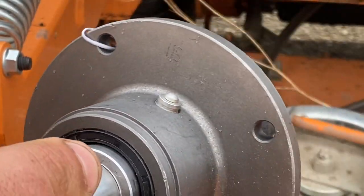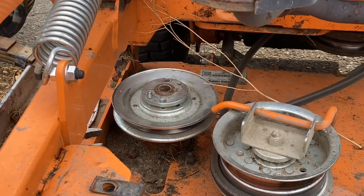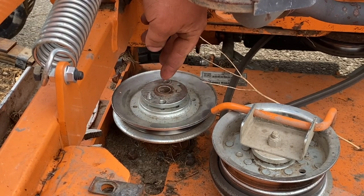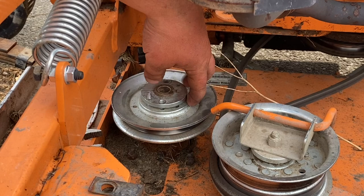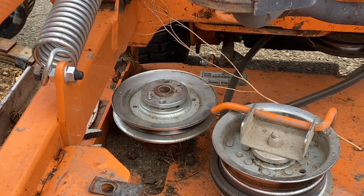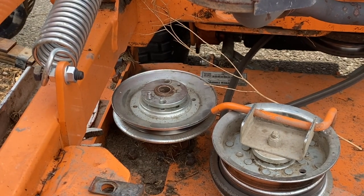First I was just going to get the pulley off, then go ahead and drop in the new spindle and put it all together. What he did was he put an impact on it. If you don't understand how taper lock pulleys work — there are two threaded holes and two clearance holes. The bolts go through the clearance holes and thread into the pulley itself to draw the taper in. Then you put them through the tapped holes to push it apart. A lot of people use impacts on them and you can get away with that on the bigger ones, but that's the size of bolt that was in there, and it snapped it off pretty handedly.